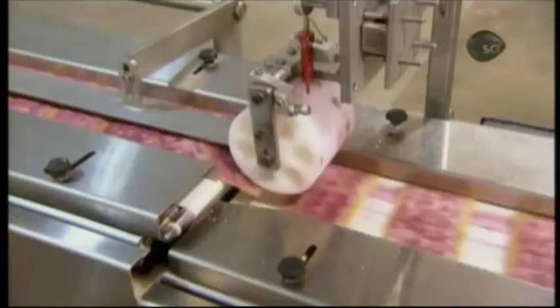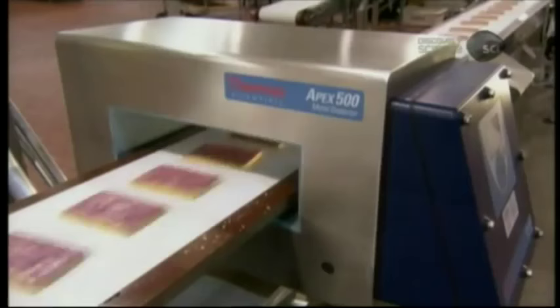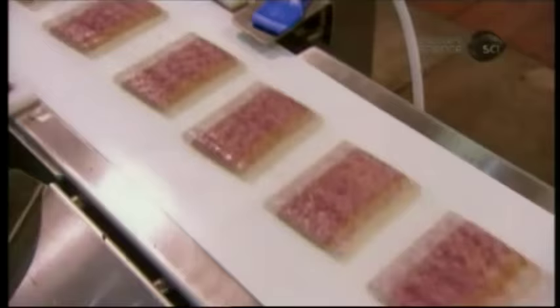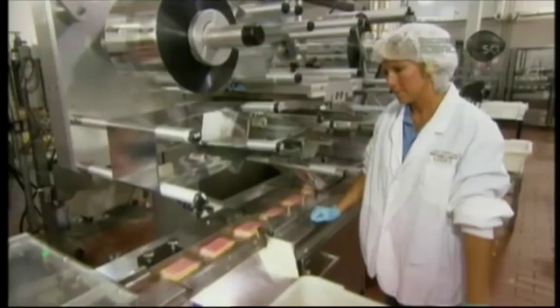Once cooled, the toaster pastries transfer from one conveyor to another. A breaker roller snaps them at the crimp line to separate them into groups of two. The completed tarts head towards the packaging line. An operator does a visual inspection as they pass by.